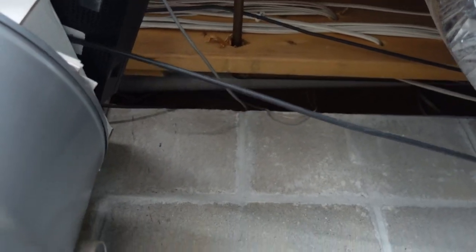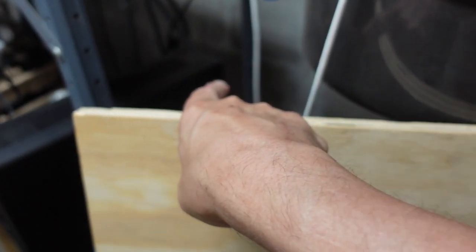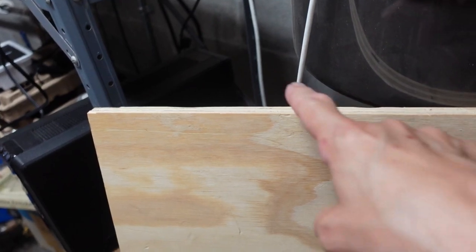And I don't know if you've ever tried holding up a piece of 3/4 inch plywood that's that big, hold it in one place and keep it level, and maintain that while you're drilling holes in it. It's not fun. Now, happily, at the top of the concrete block up there, there is a ridge and it goes back several inches. So I'm going to mount these on this plywood facing that way so that there is a lip that hangs over and I can hang this up on that ledge, and that should hold this in place at least from the top so I can drill the holes into the concrete where I want the anchors to go in.